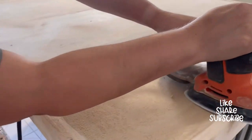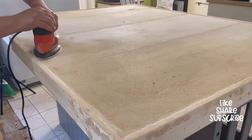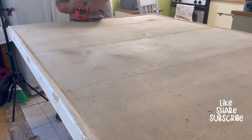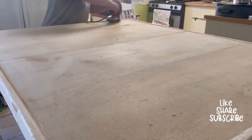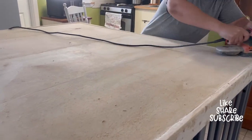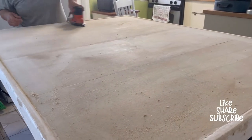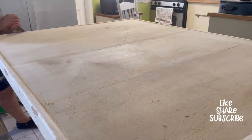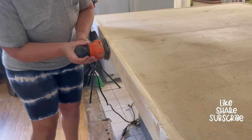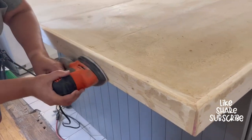Sanding and smoothing the surface to have it ready for stain and seal. This was very satisfying. As I'm sanding, I'm making sure that there's not a sharp edge, so I'm trying to make them a little curvy as well as make sure that there's nothing sticking out, that someone can put a hand on and get a splinter or anything like that. After you finish this process, make sure that you brush or sweep the area as well as give it a good vacuum, because the next step is staining and you don't want any residue on the surface.